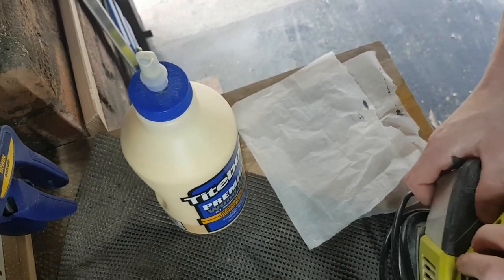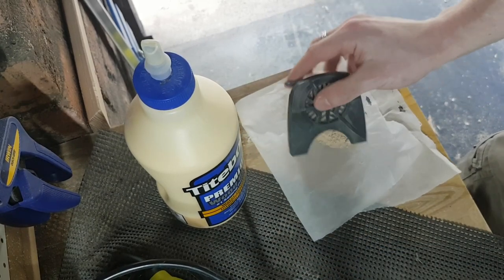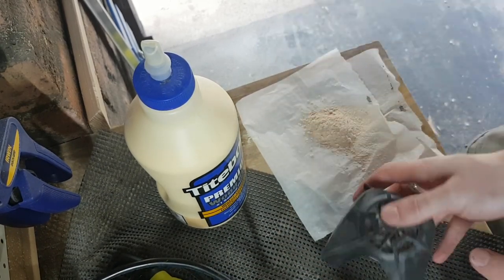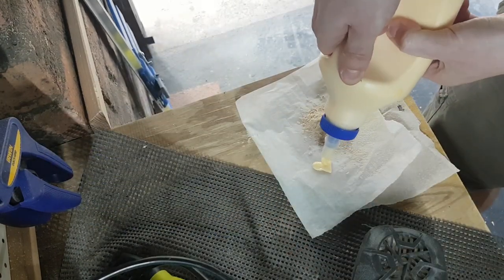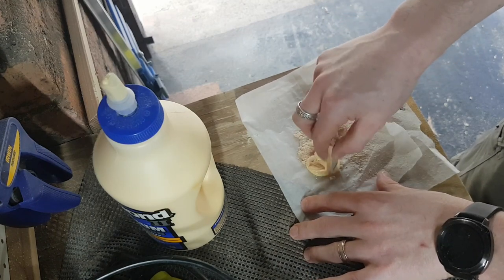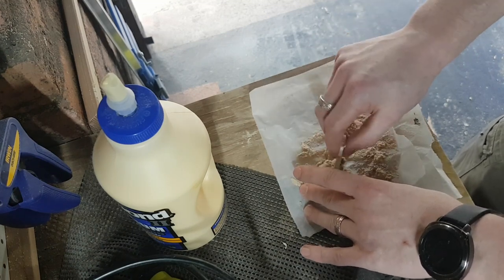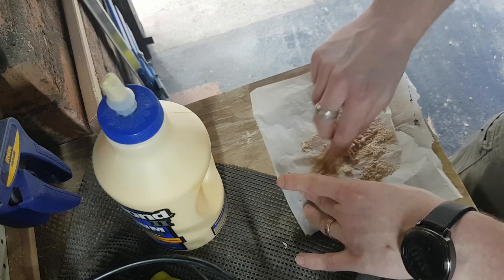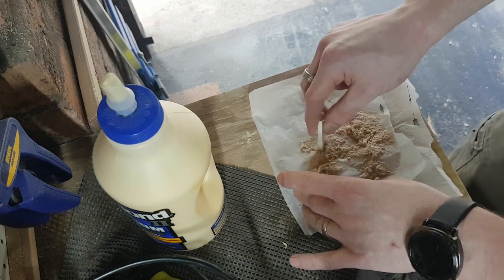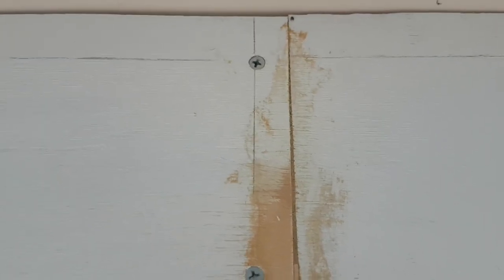I don't like that gap too much. I blame it on the uneven concrete ceiling. I've quickly cut out a shim and I'm going to glue it up in there to try and hide the gap before I paint it. There's still a tiny gap at the top which I want to bog up. I don't have any spackle, so I'm using sawdust out of the back of my sander mixed with glue to make a paste - about that much - and I'll shove some of this in the crack. A bit of 60-grit sandpaper will hide all sins. You can see the shim I've cut and sanded off, and further up there's the homemade bog. Once I get paint over it you won't be able to notice at all - well, no one but me.